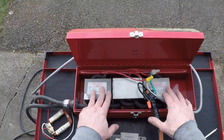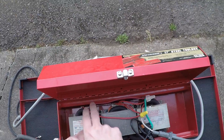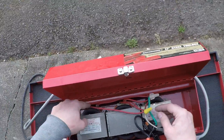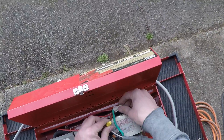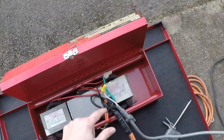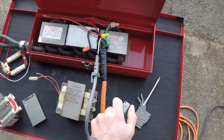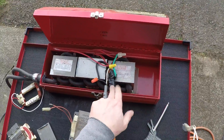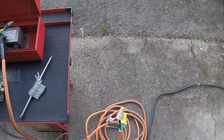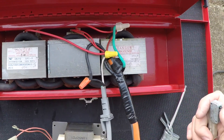These transformers power up through a positive and negative terminal — there's a positive and negative on each transformer. I wired them all together so all three positives went into one bunch and all three negatives into the other. I used a power cord with a positive and negative. The spotter gets activated by a switch with a button that runs through an extension cord. When I push the button, all three transformers get activated, they get power, and you can hear them hum.